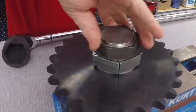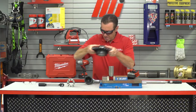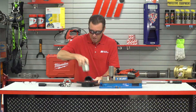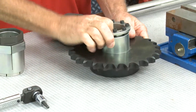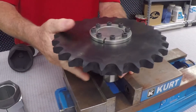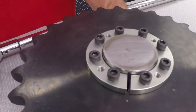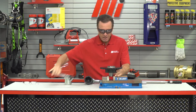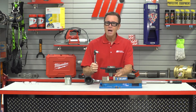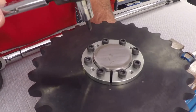But let's just say the job calls for the C192E200 for the same shaft and sprocket. I've got eight M6 socket head cap screws that only need to be tightened to 13 foot-pounds — 150 inch-pounds — but it's going to be a little bit more time consuming because every screw needs to be properly and evenly torqued.